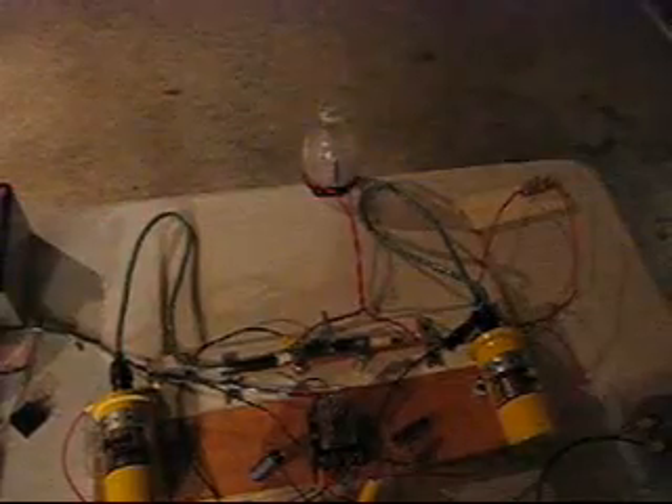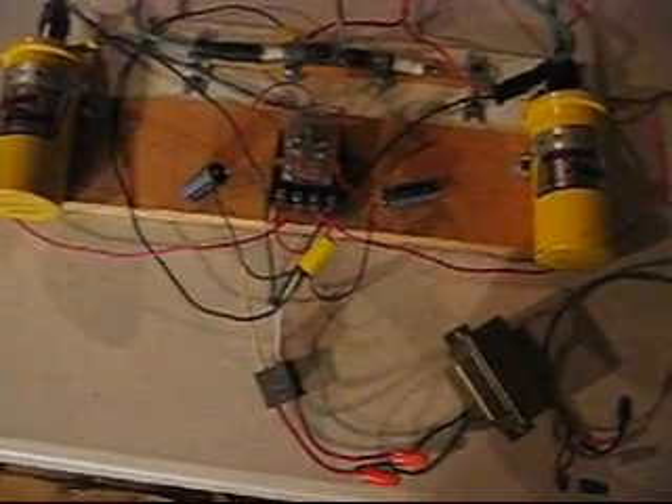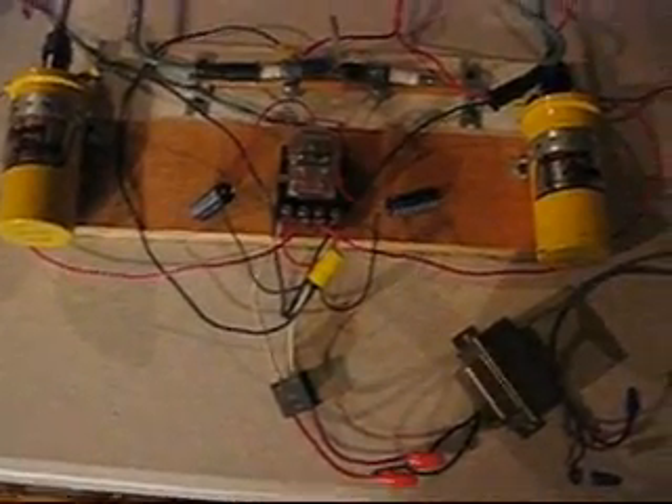The camera just can't pick up everyone. The sprites coming out of the top are only on the camera. I'm using this transformer to pulse this transformer into a rectifier, and that's giving me 130 volts DC into these two 200 volt capacitors, about 333 microfarads each. Battery's dying, I gotta go.